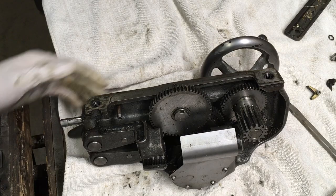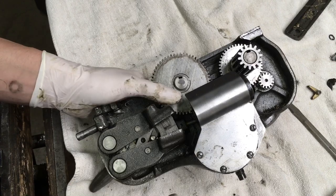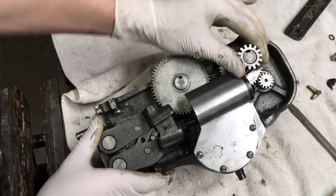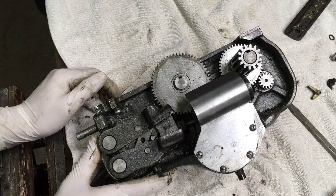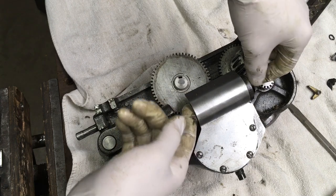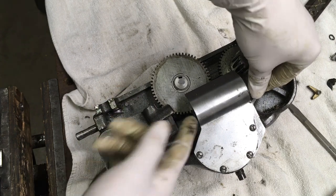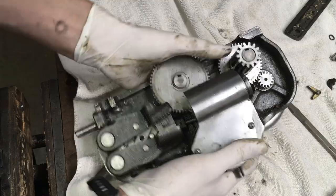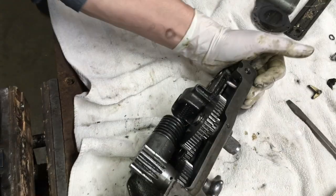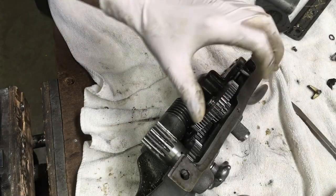Here's where the fun part begins. So this is the oil reservoir, this is the threading engagement here, we've got the clutch back in here, and this is the main gear that goes on the rack. This cylinder has a key, and this key engages with the key on the lead screw, which drives the power feed for the longitudinal and cross slide. The nice thing about doing this is if you take pictures or video of the whole process, then you know how to put it back together.